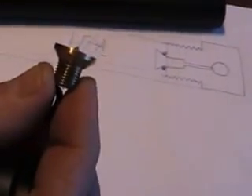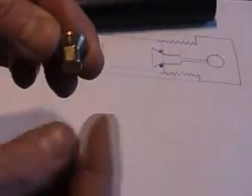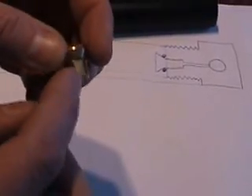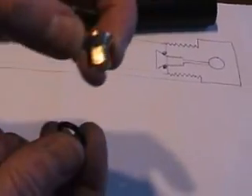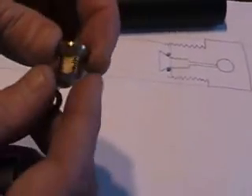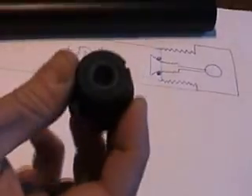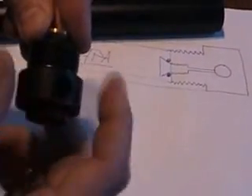Here's a homemade check valve. It's a piece of brass — I took a brass rod and turned it with a taper. I tried to get a nice surface finish. I even filed away some of the threads to make it easier for the air to squeeze itself through the threads. This is a check valve, and this could instead be a countersunk allen head screw. But I didn't have any countersunk allen head screws in this size, so I turned one piece of brass instead, fit it with an O-ring and threaded it in there. It works like a charm.